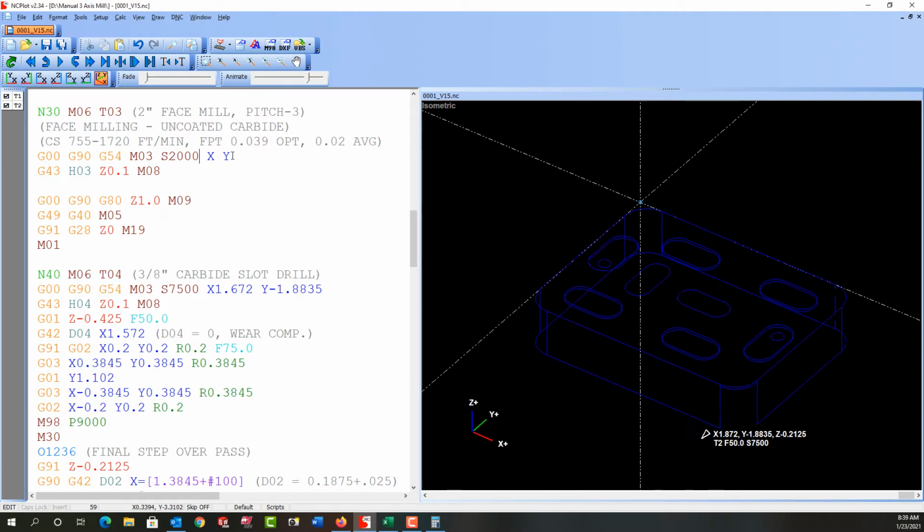And next, I'll program the Y because I'm just going to put the cutter on the center of the part. I'm not going to worry about arcing in or the fact I'm on the center. It's only a light 10 thou cut. I'm quite certain I won't pick up chatter. And the center of the part's roughly -3/4 because this is 1.496.